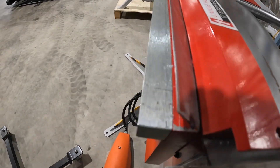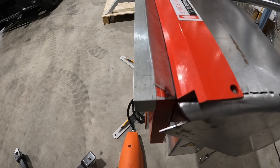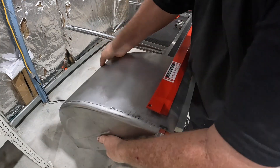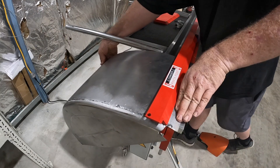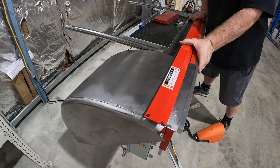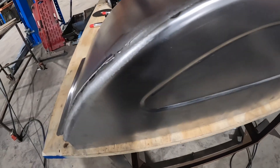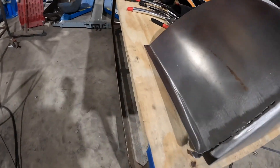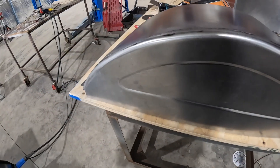You can see I've just put a bend in there — this will be a flange over the end. That's the beauty of this pan brake: you can actually bend past 90 degrees, which comes in very handy for this purpose. Here's the finished article — those are the two little flanges on the ends. I've got some gaps to fill weld, but for all intents and purposes it's ready for a mock-up.